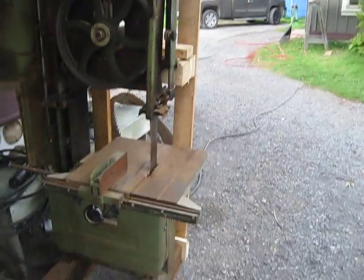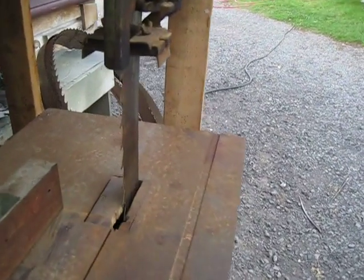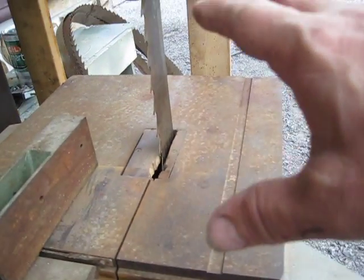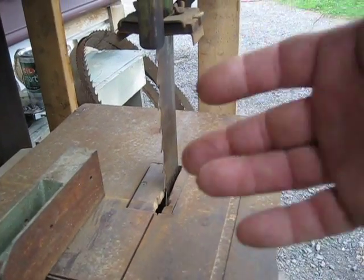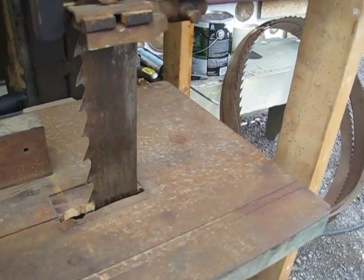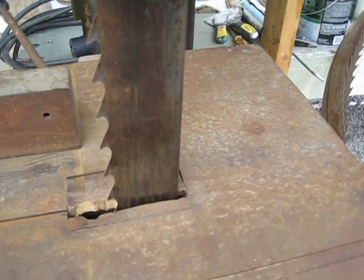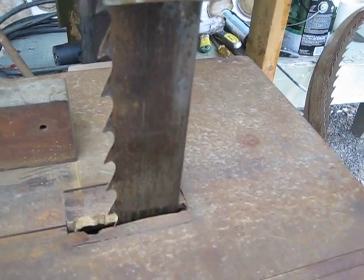It's not my traditional cast iron stuff, but these are really good saws. These blades are carbide tipped, so if you're doing square cutting work and you don't want a circular cut to come into an inside corner, these become great saws for cutting tenons on big timbers or just really deep, cheap cuts on doors.